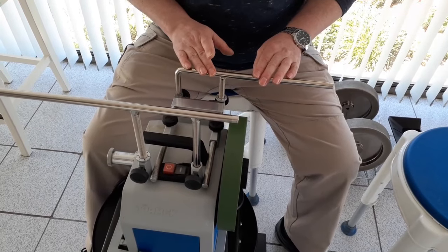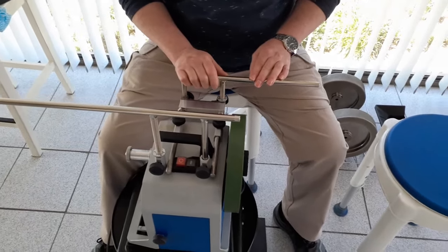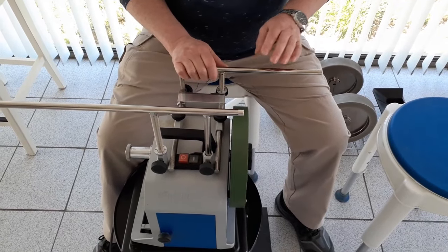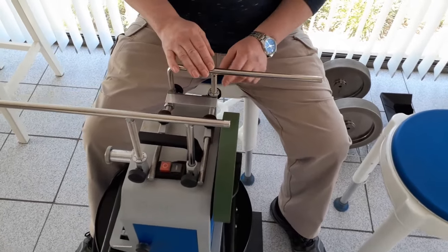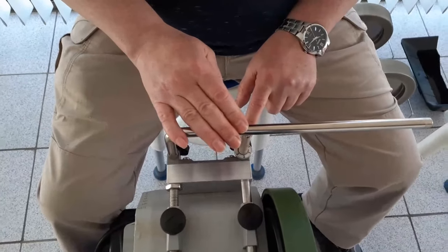I know that the difference in the radius between the two wheels is 1.5 mm, but by formulas for honing on the wheel, our software tells us that the difference must be 1.7 mm. The adjustment equals to 7 digits on the micro-adjust.